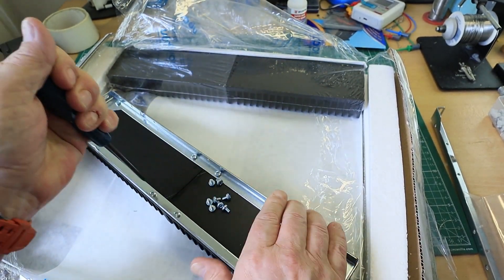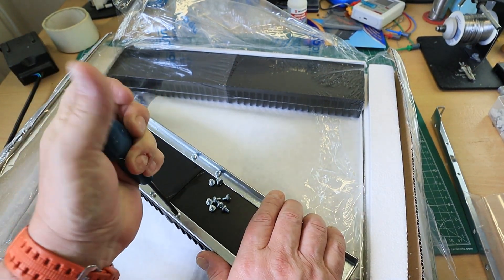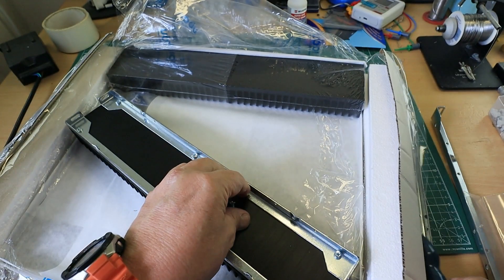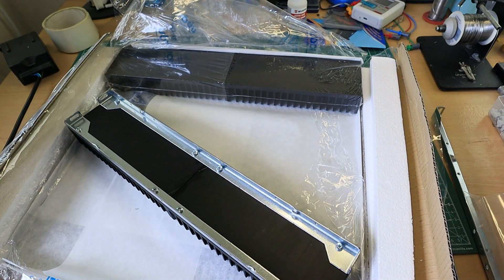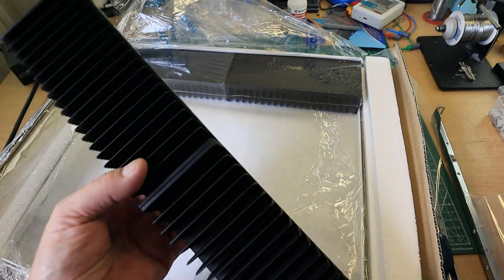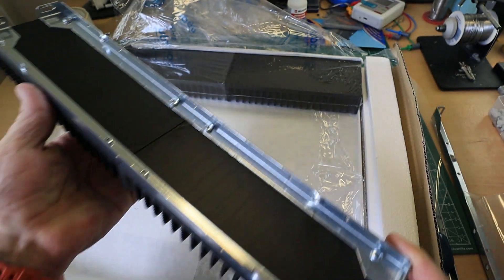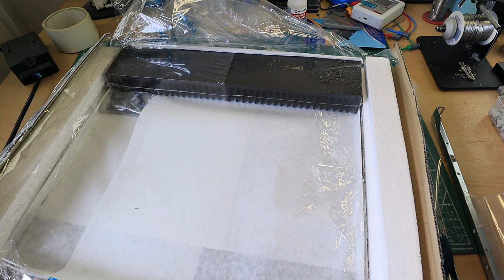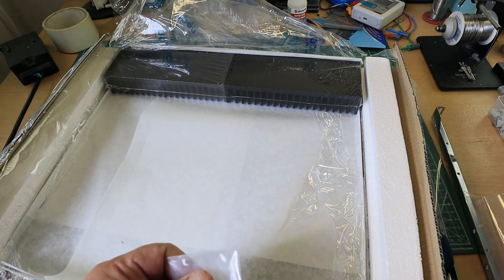If you watched the previous video on the NCC300 build, I ended up with a bias of 2.2V; in real-time use I had to wind it back to 2.15V. It's still in use now, sounding better and better by the day. These Avondale 300s — or any Avondale amplifier module, be it the NCC200, 220, whichever — do take a long time to bed in and sound their best. That's one side of the heat sink done.